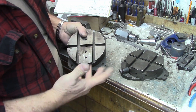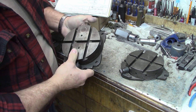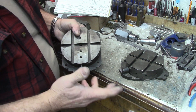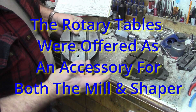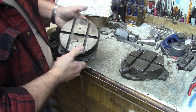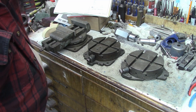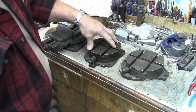I've seen one on eBay recently that's been listed several times where they've cut out two of the bolt hold-down slots so they're slotted very much like the milling machine table would be. I believe the reason for that is so they can use them on a milling machine or any other machine table — it's a little more versatile. I personally figure they're dedicated to the shaper or the milling machine, so I leave them. I have occasionally used these tables on other milling machines and just clamped them down with an external strap clamp.